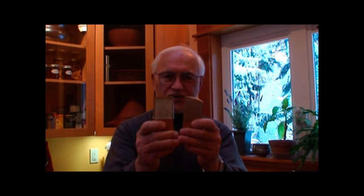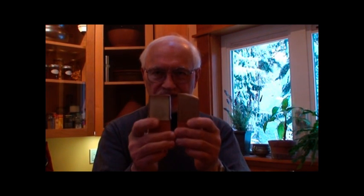As I said, this bowl has already gone through 20 cycles, so this will be the 21st cycle of this particular bowl. We also have two test samples that we're going to be testing at the same time. These are new glazes — it's the same clay body but a new glaze — and this will be the eighth thermal shock test of this particular glaze and clay body.